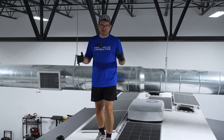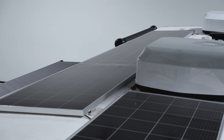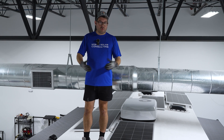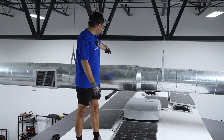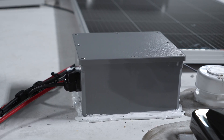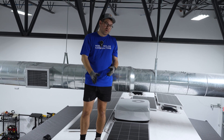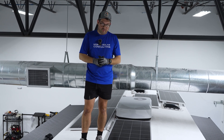We're up here on the roof. This rig came to us with four 200-watt panels already installed, and we incorporated them into what we were doing — we added six more, so 10 total, and rewired them into series of five. That's something we do all the time; if you already have some solar on your rig, we can incorporate it into a larger system. We also added this junction box — the original drop was back there for one series of five, and we added this junction box for the other drop. This one goes into the bathroom channel I showed you earlier, straight down from the roof into the pass-through and then into the underbelly, which shoots it up to the front. That central channel made things pretty easy and was a cool feature in this build.